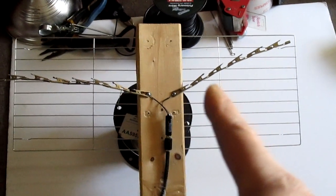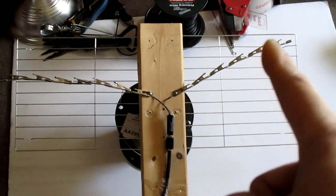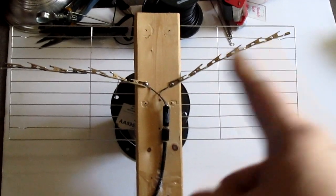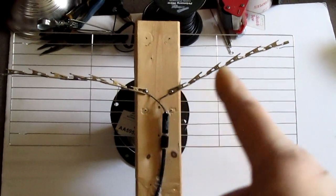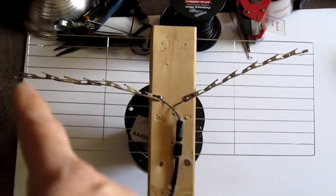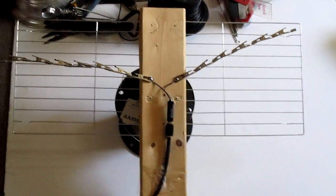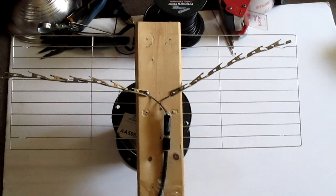These are just roach clips. You can do five and five, and for certain channels you get really nice and clear channels out of just five here and five here, which is eight and a half inches long. You would have to put one extra depending on where you are. You can search for all the channels from TVFool.com — I'll link that in the description.